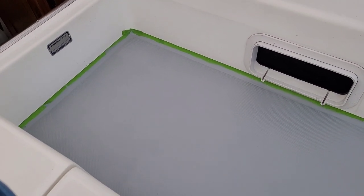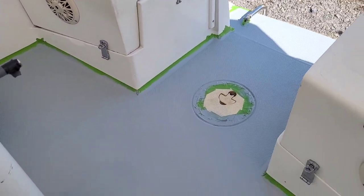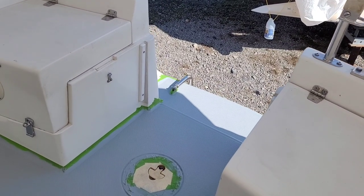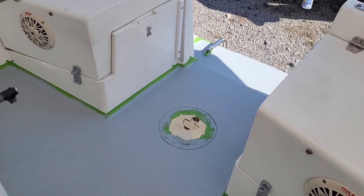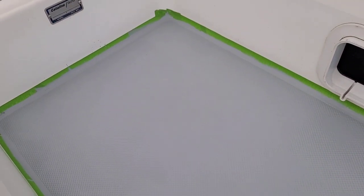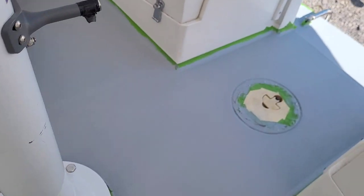I've now done the second coat and I'm going to let that dry. I'll head home in a couple of minutes and come back tomorrow to remove the tape. It's supposed to rain tomorrow, so I'm hoping it won't rain for at least the next four hours — by then it'll be cured enough that rain won't matter. There are two coats of the Interdeck with a foam roller, and you can see the texture is still there. I rolled in the same diagonal direction as the non-skid pattern, and I'm really happy with the color — it comes damn close to the original.